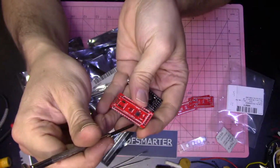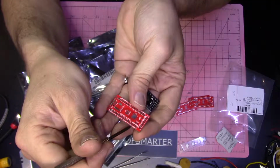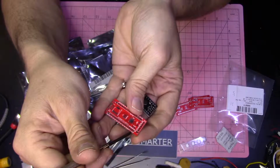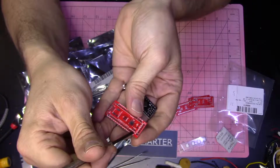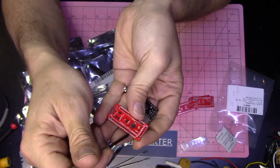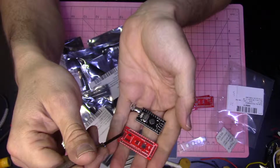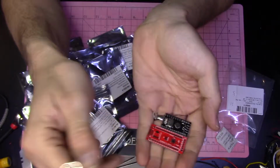So what I did with mine is they're all silk screened on. They're really tiny, I know, but they're still silk screened on the outside, so none of the solder joints come in them, and they're dual. I dual labeled a lot of them so that they showed that if you have D13, you still have the SCLK, D12, MISO, your D11, MOSI. Here you got your A4 SDA, your A5 SCL. I just thought it was a better design. You know, it's obviously a fraction longer.